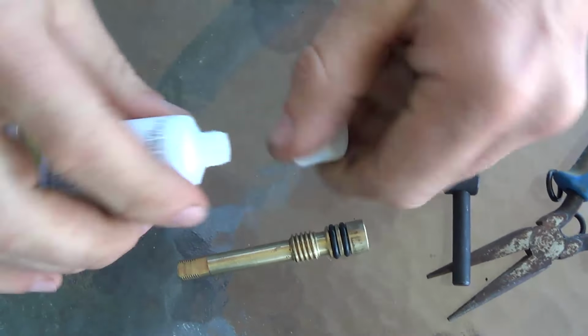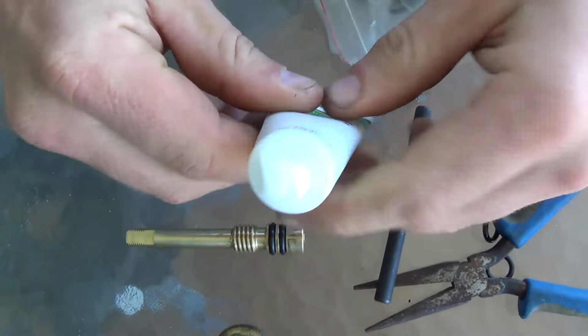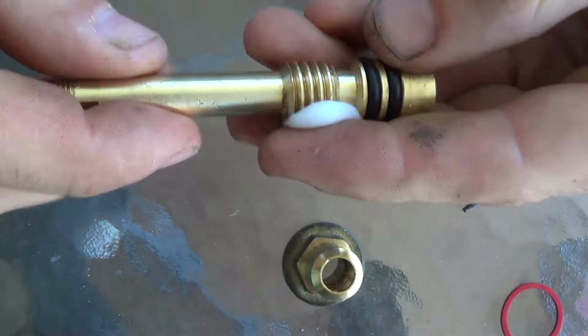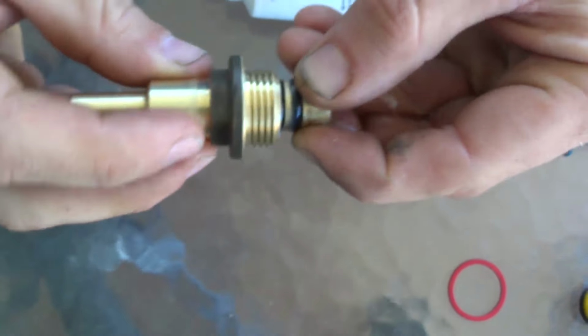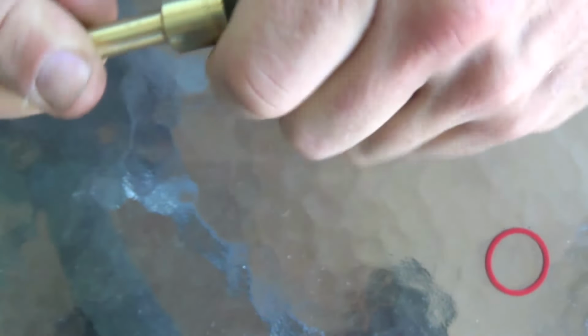We're going to put some tap lubricant or tap grease on some of these parts now. So you can be quite liberal here. So put a bit of grease on there, a bit of tap lubricant, and then just smooth it around with your fingers, and also put some on the rubber O-rings. And put it all over there because it's going to be the lubricant. And now screw the spindle back into the spindle housing. Nice. And then screw that in like that. That's very good.